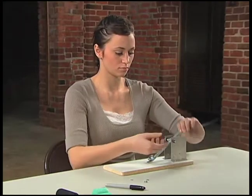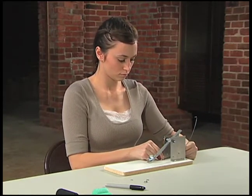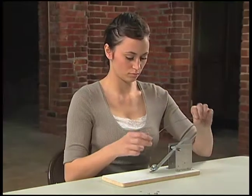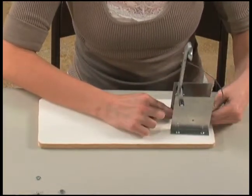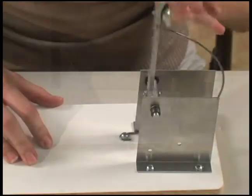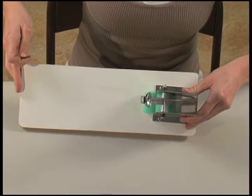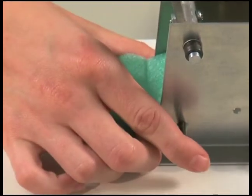Then insert one end of the wire into the arm and bend it through the sides. Remember to put a washer on the screw before using it to attach the wire to the board. Check that the arm moves freely. Slip the bumper between the sides, starting from the center of the board. Be sure that the wire is between the side and the bumper so it swings easily. Use a nail pushed through the sides to hold the bumper in place.